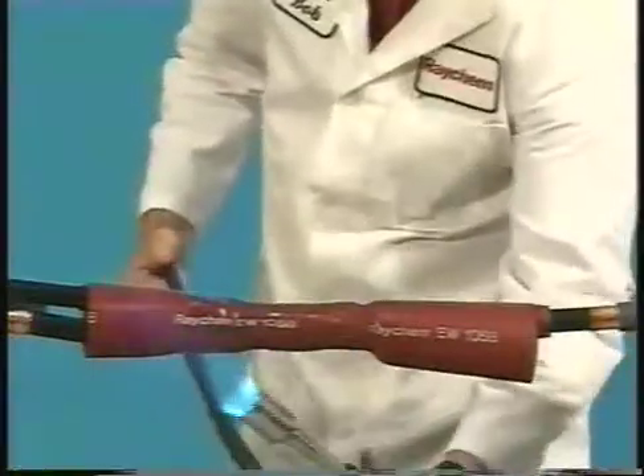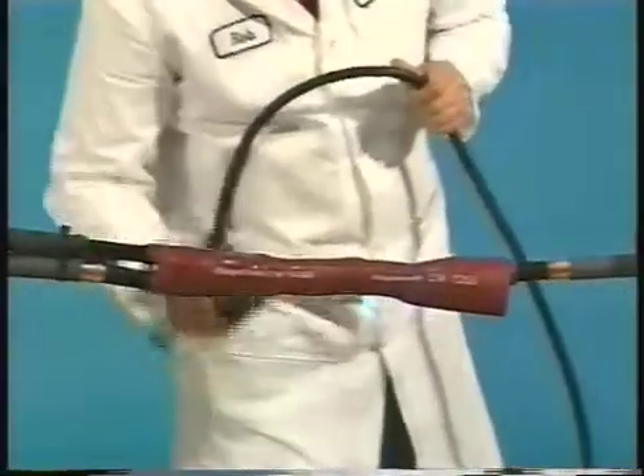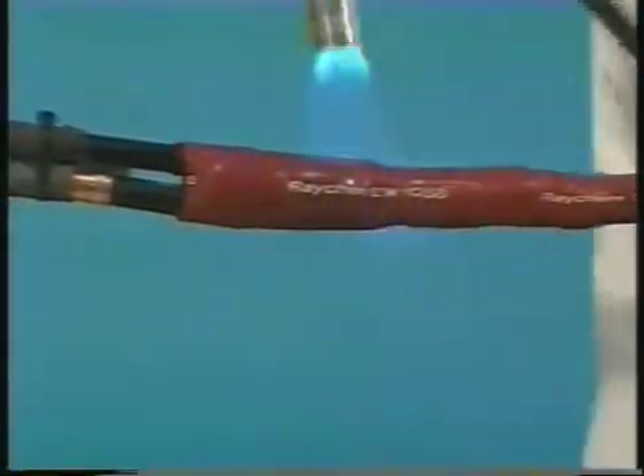The ICP is designed to melt and fill the gaps between the main and tap cables. You'll know that sufficient heat has been applied when the ICP shoulders have rounded off and have started to melt. When the tap end has shrunk and the ICP has started to melt, work the torch as before toward the opposite end. Apply enough heat to shrink the tube and smooth the underlying profile of the ICP and SRM over the connector.